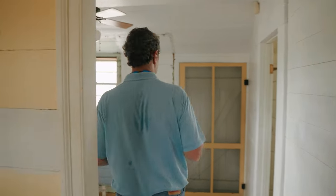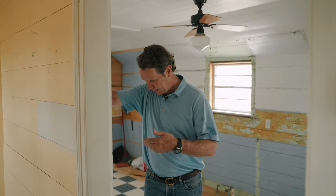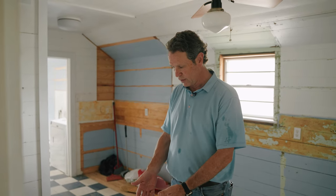Walking back into this area, something happened here. The floor — I'm looking at every single detail: the color, the type of grain, the color of the wood, the width of the board. If we measured those boards, they're all random widths — eight inches, five inches, six inches, three inches — all different. Early industrial for Texas, they probably didn't have sawmills around here, so they got those floors another way. By 1915, they absolutely had sawmills, so every board is exactly the same, tongue and groove. I also see an aluminum window. Aluminum as a window product doesn't happen until the 1950s after World War II. So we've got wood windows in some areas and aluminum windows here.